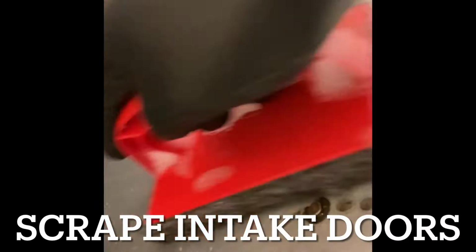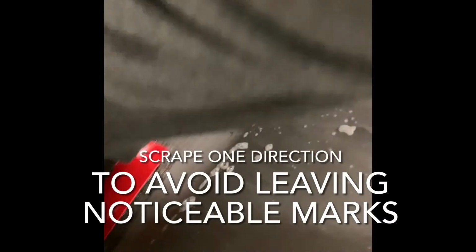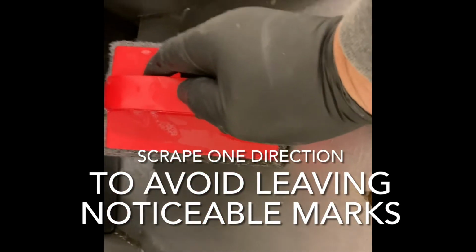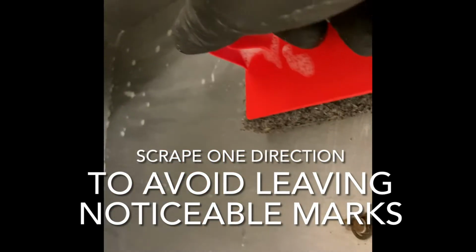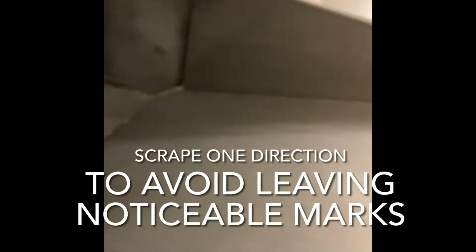So same thing with all our doors. We scrape the inside, making sure everything is looking clean for the residents. And then in here, you notice I'm going one motion with the scrubber, because when you're using this steel wool, this is actually a good thing that I used. If you start going all over the place, you'll start seeing little scratch marks on these steel doors. So what you want to do is make sure everything is going down together one time.